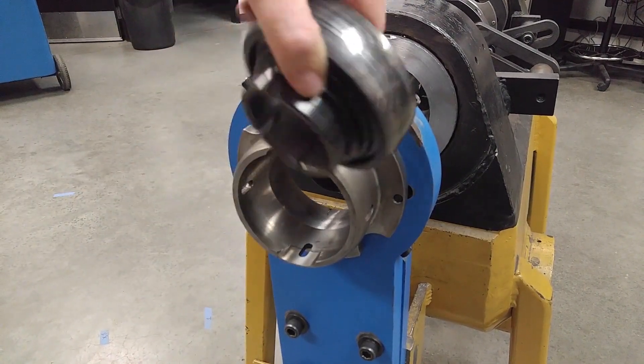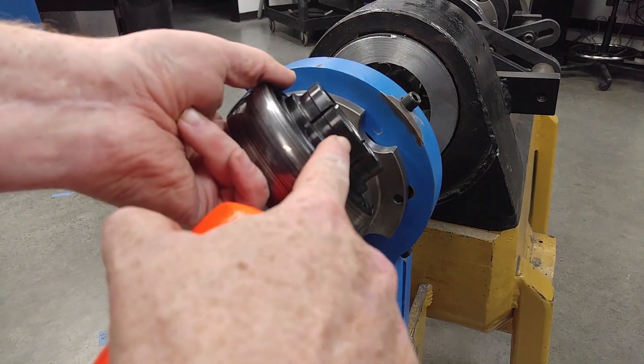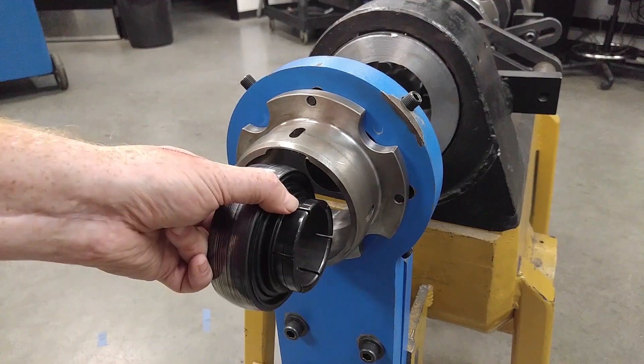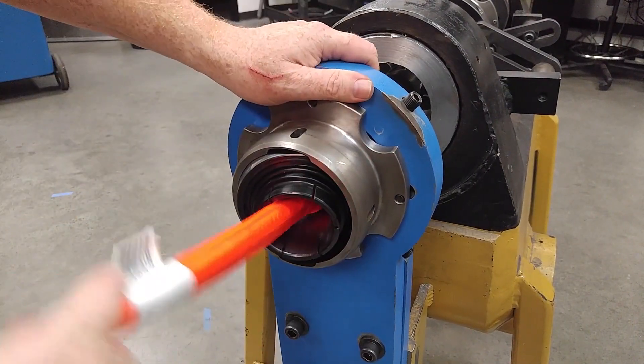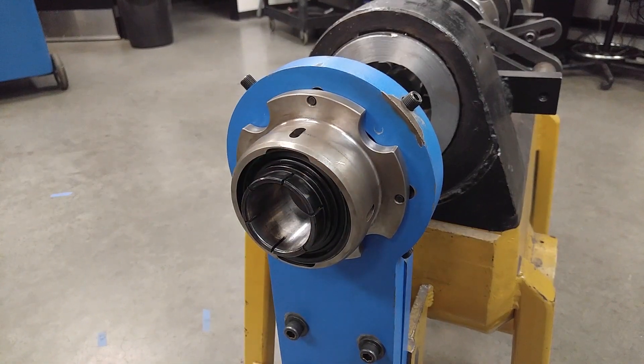You can see that this is going to protrude out quite a bit further — that's the obstruction for the drive unit. So all you have to do is stick that back in, roll it in, and now they have access to the clamp collar and can close up the gap on the bar and hopefully eliminate all their chatter.